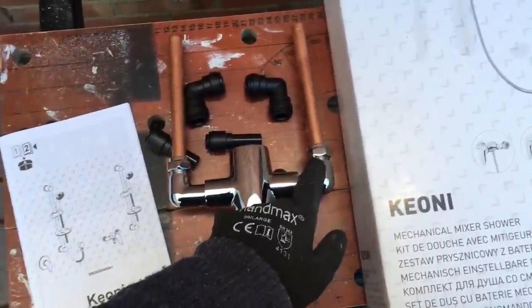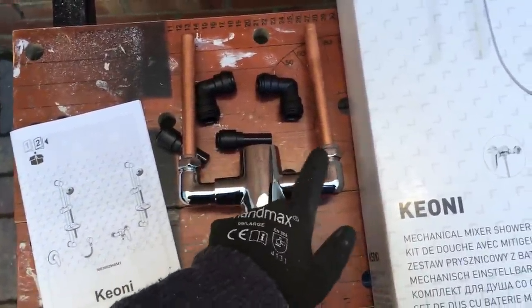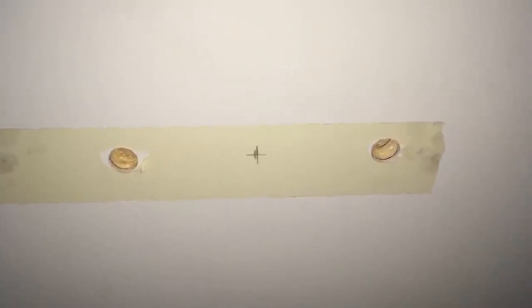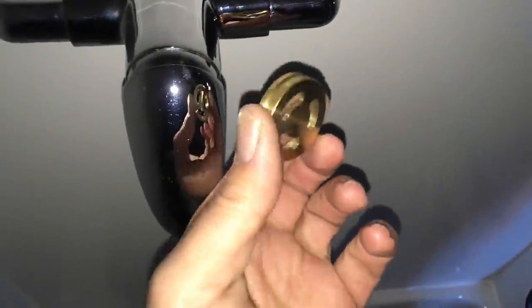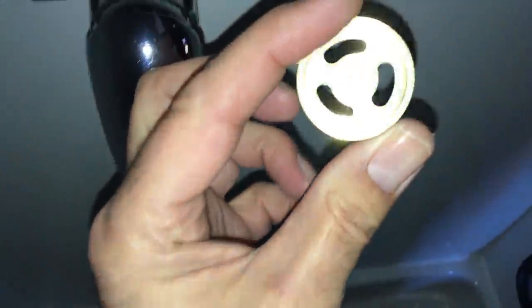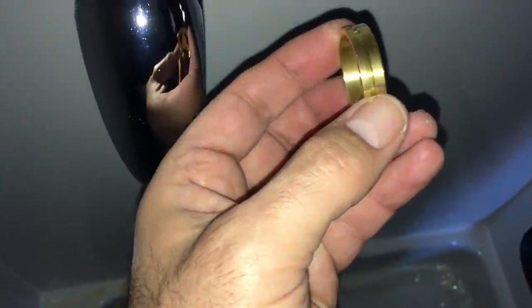I'm going to drill a couple of pilot holes to start with and then measure off of that, make sure it's level before I drill 16mm clearance holes. So I've drilled two 16mm holes through the shower cubicle into the stud work on the other side — that'll give us a good screw fixing for the actual shower mixer. I can put some decent two-inch screws in there and that's going to support it really well. This is the little brass bracket that holds the mixer onto the wall — you put three screws in those slots and then the mixer just nips up onto that groove with an Allen key.